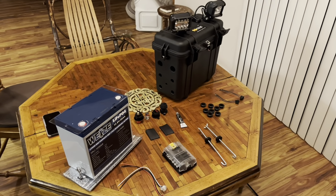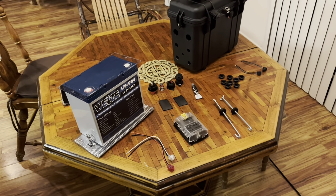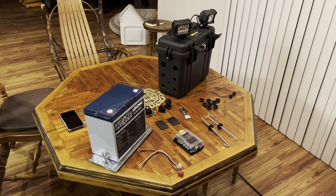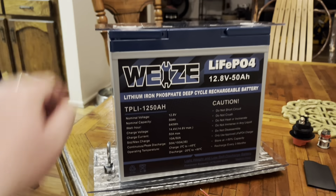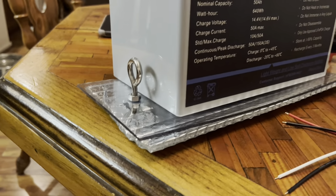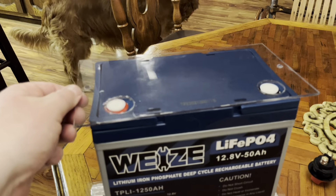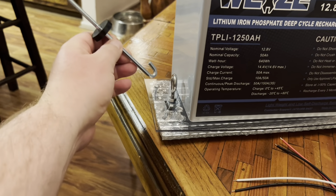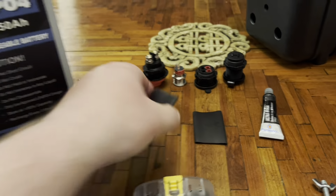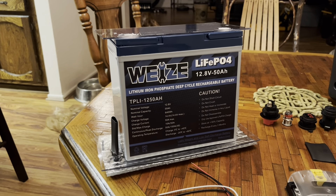I can't remember where I left off, but I'm about to start mounting a few items on the box, and I also figured out how I'm going to secure the battery in. How I'm going to mount the battery: I've taken two pieces of Lexan — I should have gotten a thicker gauge, but for right now it's fine. I put some eye bolts through there, put some cap nuts on the bottom, and bolted it through — these are nice and steady and secure. I made some holes for the positive and negative, and then quarter inch holes that are going to accept these battery tie downs. I'm going to use some big heavy duty shrink wrap, put the battery tie down in there and then shrink it — that should hold well.